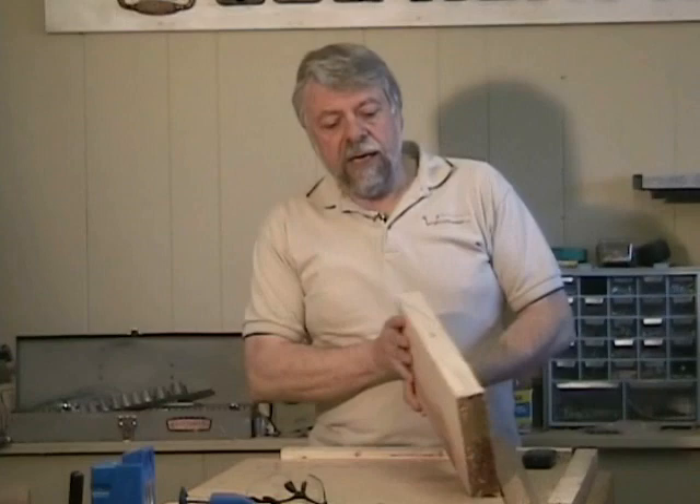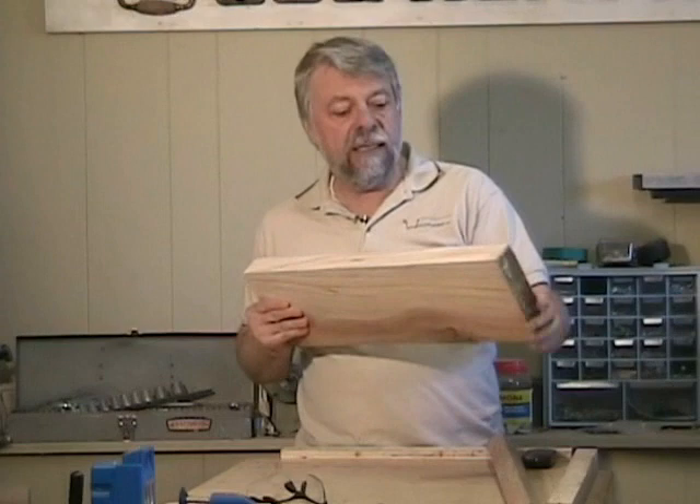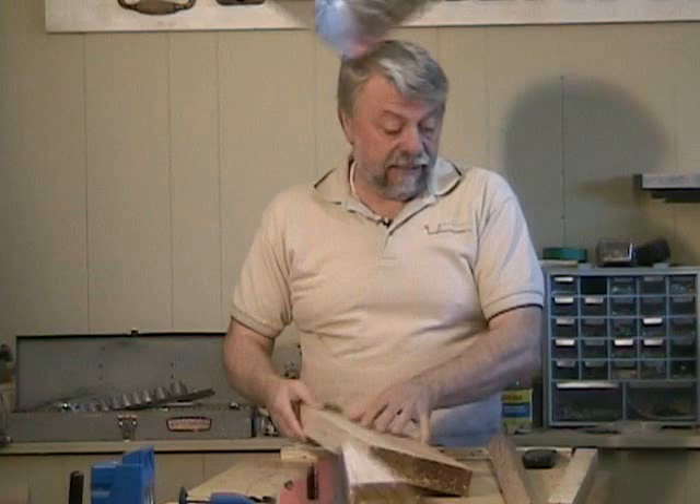What I like to do is simply use a large piece of timber — this one is almost an inch and an eighth thick. I've already planed it to that thickness, and I'm now going to cut basically square strips from this so that I end up with a square piece of framing material that'll go together to make the frame.